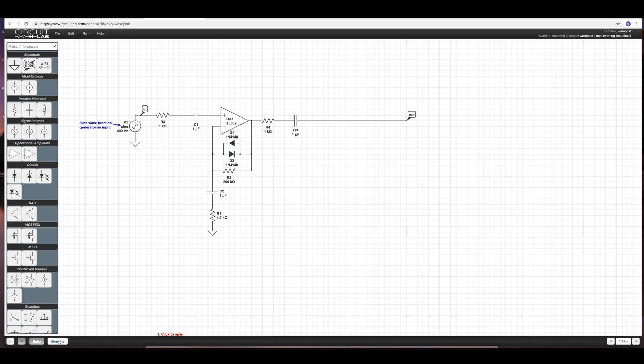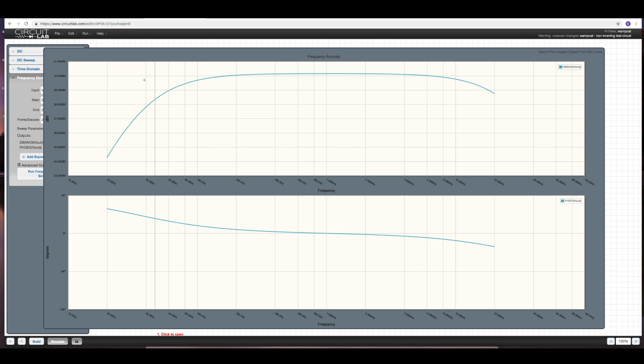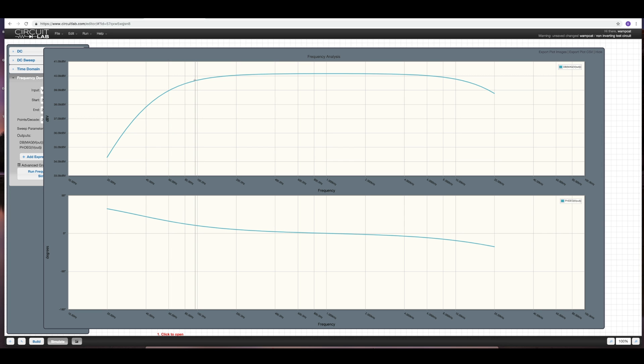We can go to Simulate and this will give us a rough idea of what's going on EQ-wise. From 20 Hz through about 40 Hz — ignore that, because your guitar speaker is not going to reproduce that anyway, maybe not even 60 Hz depending on what type of guitar speaker and amp you're using. So looking in this area, we can see it's boosting about 40 dB, assuming there's enough headroom. Since we're clipping, we know we're also clipping that signal, but this part isn't going to show that — it just shows a rough idea of the EQ curve. Even though I've made the parameters as wide as I can for as full-frequency a response as possible, we're still going to take away a bit of bass — not much though.